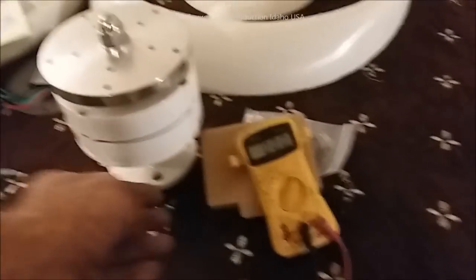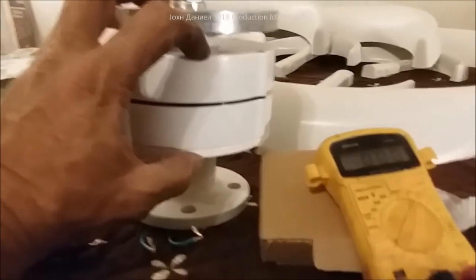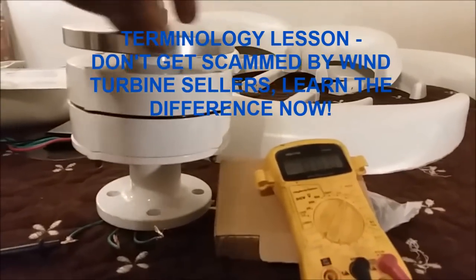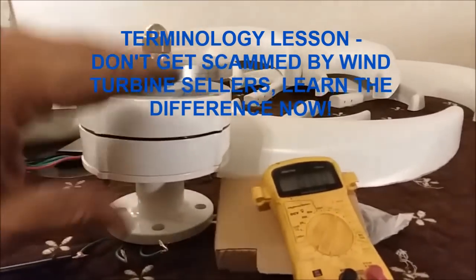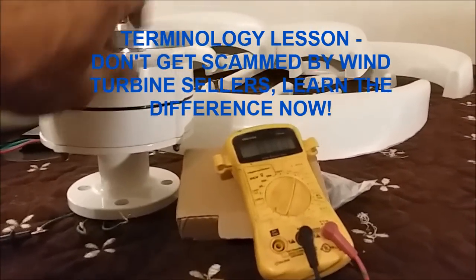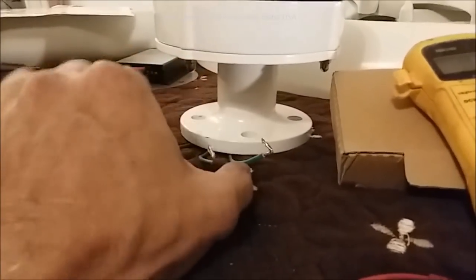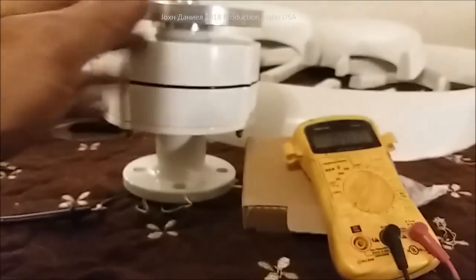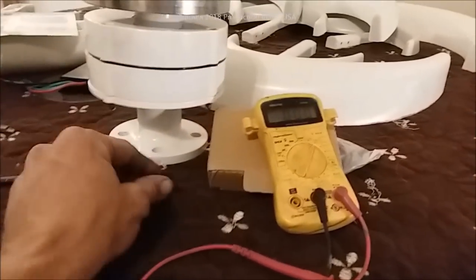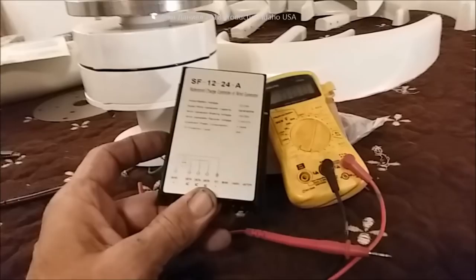I've tested one of these before, but here's the notable difference: this turbine PMA — the motor, the generator head — is three and an eighth inches. If they're called a PMG, a permanent magnet generator, they're DC-powered like a treadmill motor. But this is a permanent magnet alternator, which means it alternates AC voltage, not DC. A PMG produces direct power; this has to be put through a controller. Here is the controller — only about 20 bucks — and it has a built-in braking system.